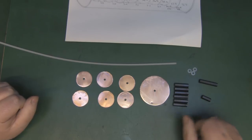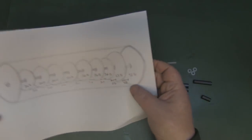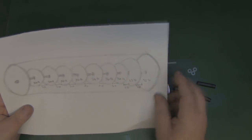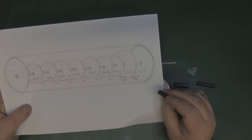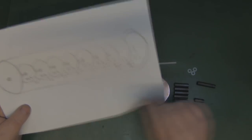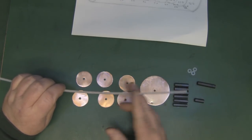I've got most of the spacer sizes sorted. The distance from the main driven element to the back reflector of the can is 38 millimeters — I've got a 40mm spacer which I'll trim slightly with the Dremel. For the driven element to the first parasitic element I've got a 20mm spacer, which I'll make up with nylon washers. For the remaining parasitic elements spaced at 30 millimeters each, I've got nylon spacers that are exactly 30 millimeters in length.